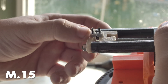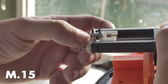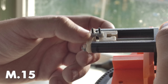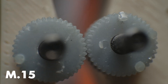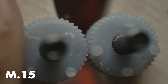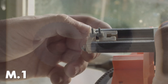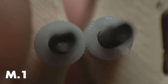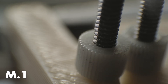Onto the last two sizes. To me these look just like circles, but I can feel there are teeth formed. We can see in the slicing software that in theory they should be there. Onto 0.15 — we're essentially done at this point. The gears are still meshing and turning, but the teeth are very much bumps. And at module 0.1, a similar story, but the bumps are even more exaggerated. They're kind of meshing, but they're really just bumps rather than teeth now — not good enough to be reliable.